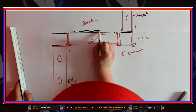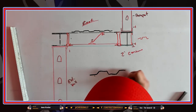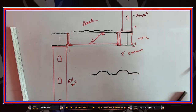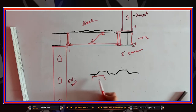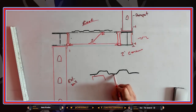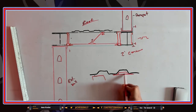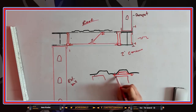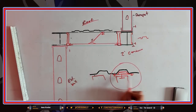This is Q deck, so let's draw a bigger version. What happens if the track doesn't land on the rib? Sometimes your track is gonna end up in the middle or offset, and it's pretty flimsy and weak. This is where you build clips — you take a stud, cut it to fit in, cut the flange so it's flat, and the stud goes in there so it's nice and strong and flat. Then your track will have something to screw to.